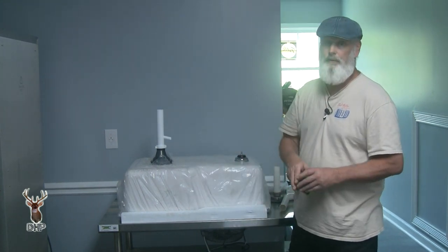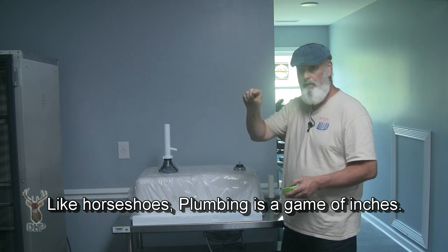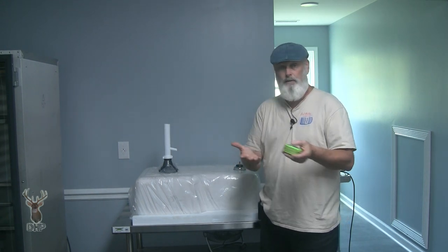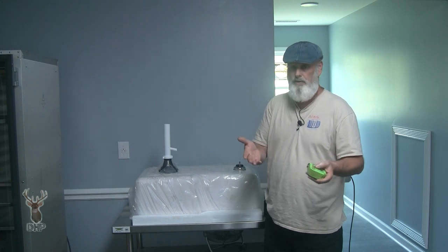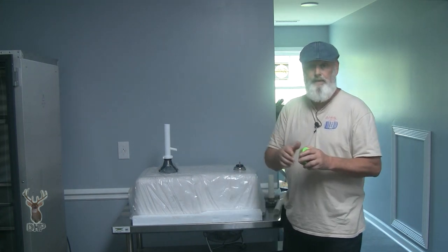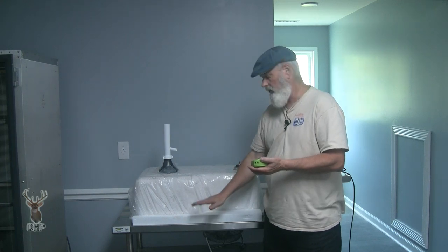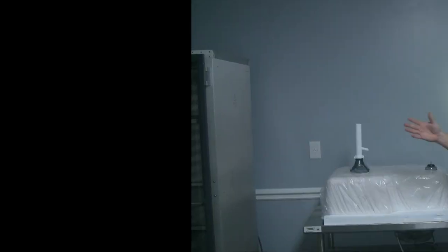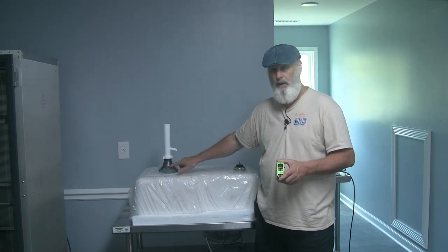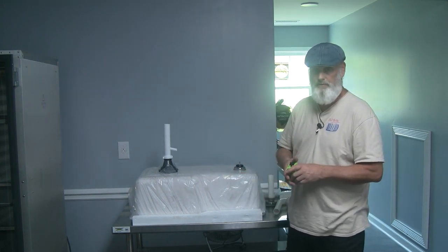It's a 10-inch tub, so I have to be at least 16 inches down for that drain. You can gain an inch or so if you have a top-mounted sink because you're going on top of the countertop thickness — maybe an inch for butcher block, three-quarters to an inch for a rock top, or even less for solid surface. But you're not going to gain that much height. The question is: do you have the room under your sink to do that? You want to measure it.